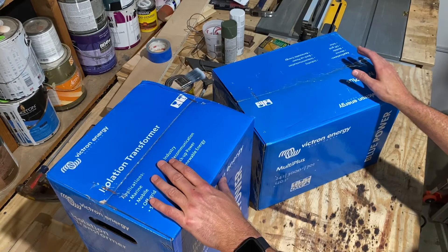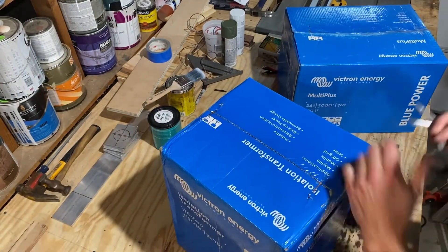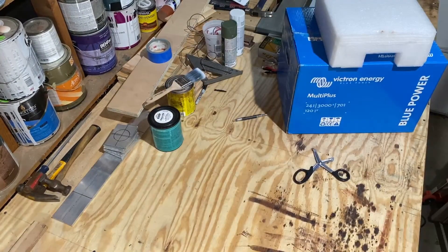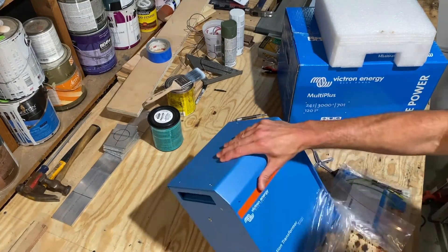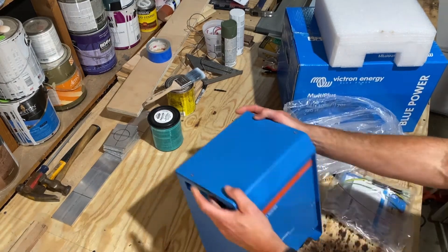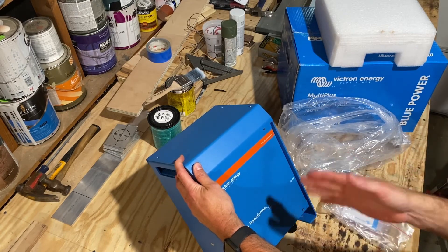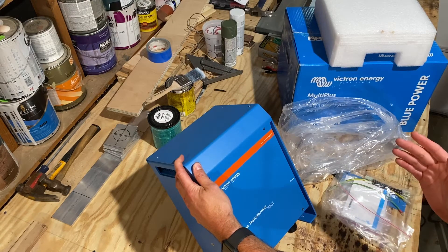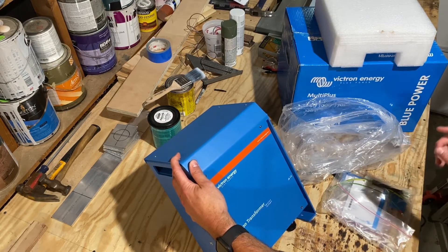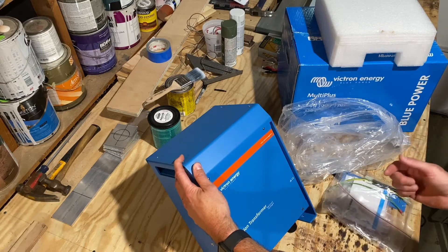This is what's going to keep the boat isolated and separated from shore power, to make sure that there's no stray current moving into the boat. What it does is take power from the shore power circuit, bring it in, and then completely isolate it from the boat. The point being that we don't want any stray or leaking current coming from the marina into the boat itself. It's all done magnetically, so we're galvanically isolated — there is no direct electrical connection inside.